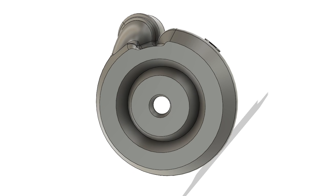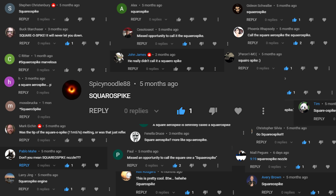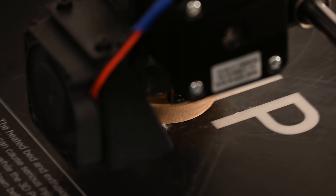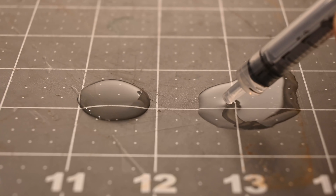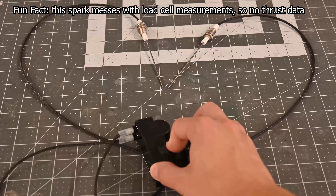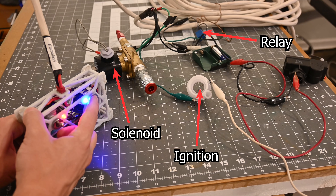I made two variants: one with an inbuilt nozzle and one with threads to accept exterior nozzles, like the fan favorite Squaro Spike. These external nozzles will be secured with O-rings and some superglue, and they'll all be printed out of either clear PETG or some wood PLA filament that I thought would do a good job of charring before it melted. With everything thrown together, we can test this with water - and yeah, there are some issues. Luckily, alcohol has much less surface tension than water, so retrying with isopropyl alcohol made for a lot better results. The ignition will come from a barbecue igniter, and the compressed air will be controlled by a solenoid, in turn controlled by a control panel I made for an earlier video.